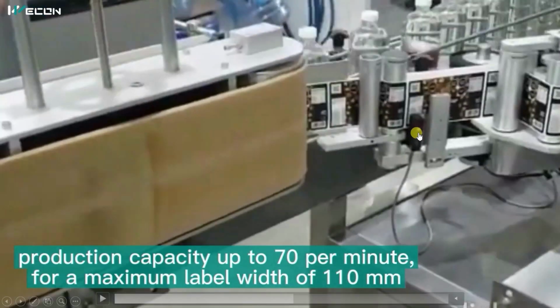There is also another sensor over here. So you may have seen one black square portion in all the packing materials, whether in a packing pouch or packing bag or bottles. So what is that black square? So here there is the color sensor. Every time the black mark comes to here, this stops. So that particular portion is applied to only one bottle. So this is how the machine comes to know that this portion is going to be applied to one bottle. So that one black square mark is in all the packing items that you have purchased.